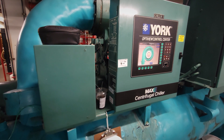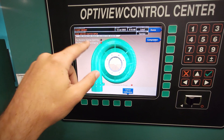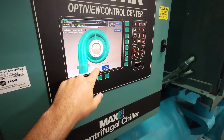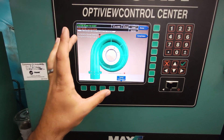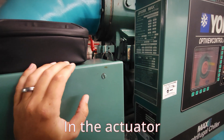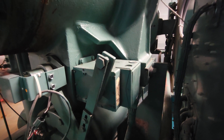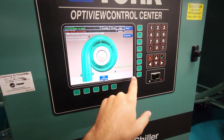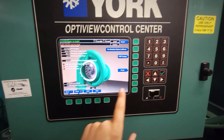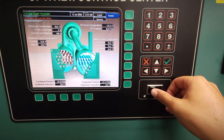We're on the tail end of the process — it already drove to full open, stopped, and now it's driving back to full closed. The calibration is still in progress but it's just about finished. I think we got out of calibration or we've got a bad motor switch, because I'm watching it and I don't see any more rotation — that should be its full closed position but it's waiting for that motor switch to make. All right, PRV calibration was successful. Vane motor switch is closed, we're in auto, everything's where it needs to be — go go gadget.